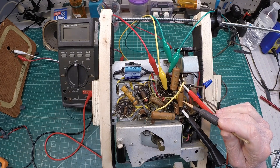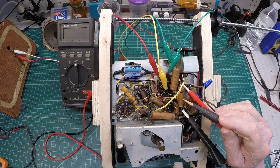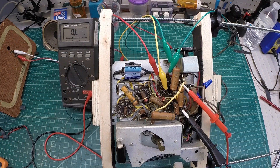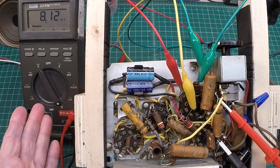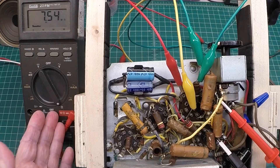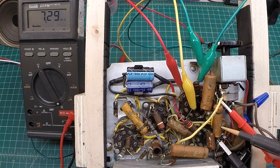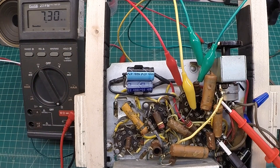I'm going to assume every capacitor in here — less any micas, which would also be suspect in the oscillator section — are leaky. Let me check the DC resistance on this particular cap. You can see it's a leaky cap even with just a low DC voltage applied. So again, the importance of getting these old capacitors out before we even turn on a radio. This capacitor is not effectively blocking DC as it should, as indicated here, even though the resistance readings are around 7 meg.